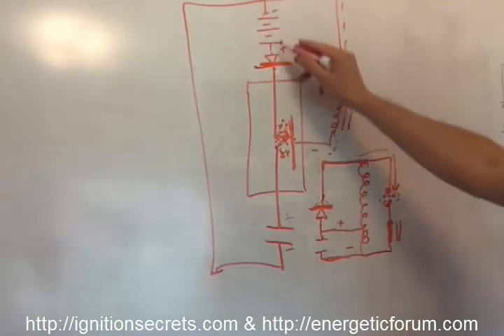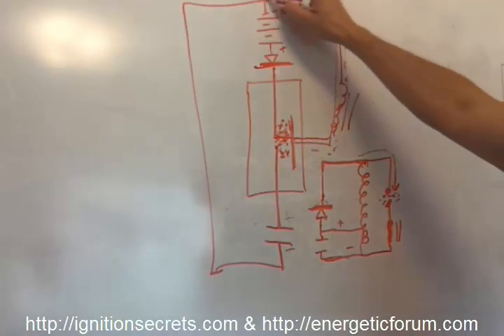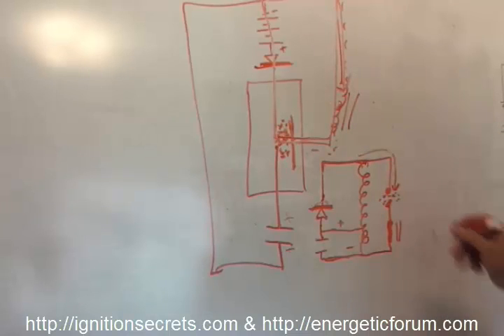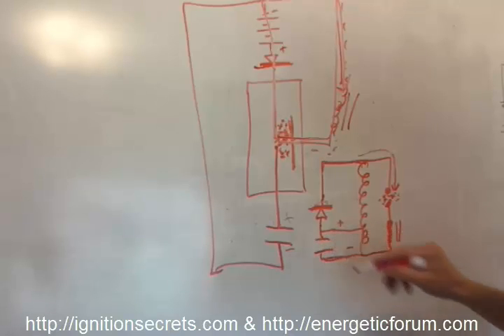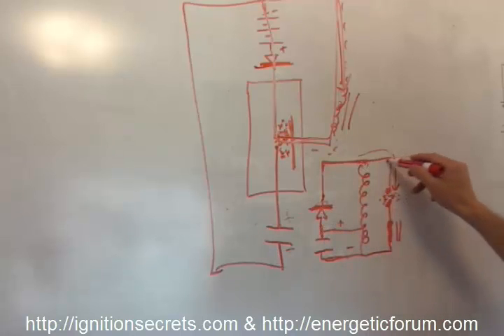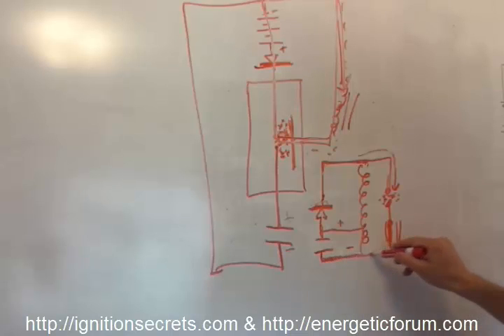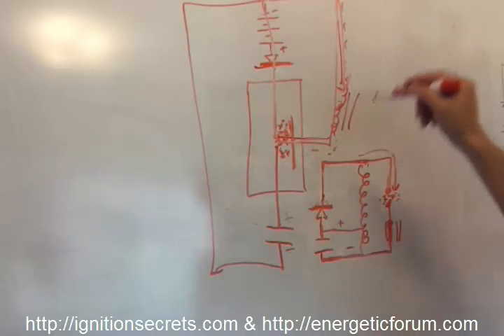As soon as this gap is ionized, the battery can discharge through the coil with current coming in the opposite direction. The low voltage source — a capacitor of a couple hundred volts and however many microfarads — moves through the diode, over the gap, and through the inductor motor coil, giving a high current punch. It is a 100% mirror image analogy of the gray tube.